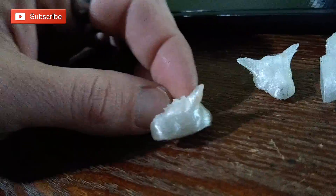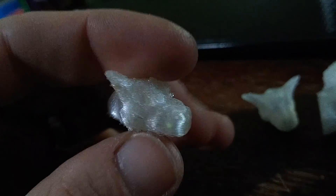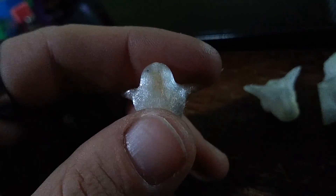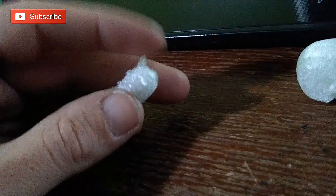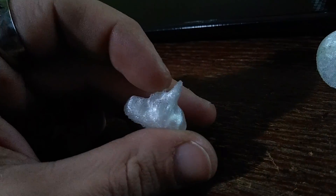And some issues it had caused. You can see here — this same model, the one I printed yesterday — if we look closely, you can see some brown discolorations, a little bit of green from some filament I had in there before. That discoloration happened because it was burning — it wasn't flowing through evenly. I made those adjustments to my Bowden tube that I talked about in the comments, and then it came out pretty clean.